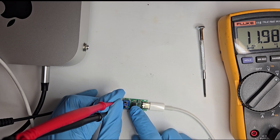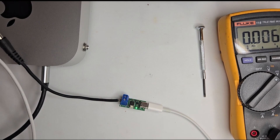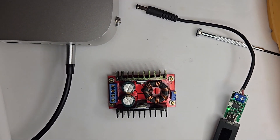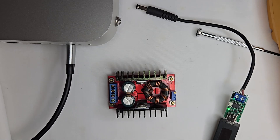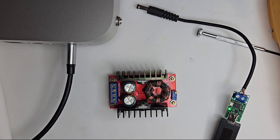If you don't plan on using a bunch of accessories and pushing your CPU to its limits, I suspect simply using a USB-C board will work. However, if you need to go over 60 watts or more, you will need to install another device called a buck converter, which will take the 20 volts at up to 5 amps and reduce it back down to 12 volts. Personally I'm not a fan of this, but because there is no setting for 12 volts above 3 amps, we're pretty much at the mercy of the USB-C standards.